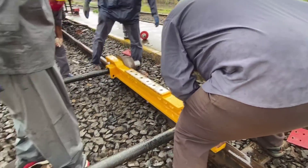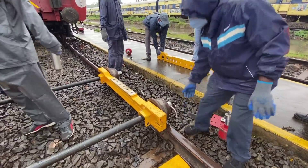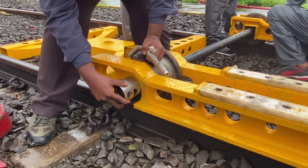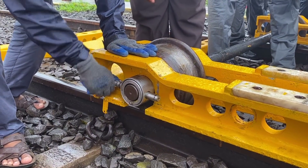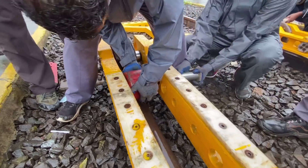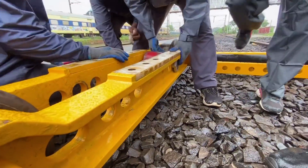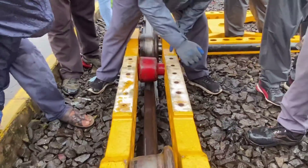Push the inner beams into position. Rest the outer beams on the outer side of the axle and also place the outer wheel spacer and lock it with the fixing bolts. Place the bearing wheels between the two beams in the right position depending on the diameter of the wheels to be supported. Then lock the bearing wheels with the pin and cover.